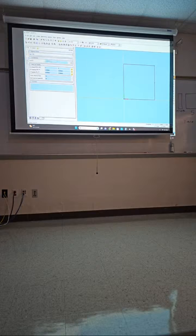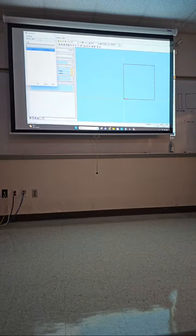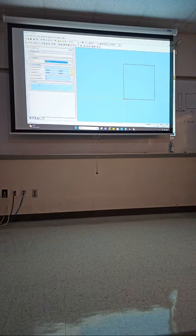So we go to Library. You're going to have metric and inches. This is America, so inches. Then we go to this funnel and we look for face mill. Face mill, right here. Okay. What size do we have outside? A 3-inch face mill. That's what we have in the machine right now. I'm losing my voice. Click OK.